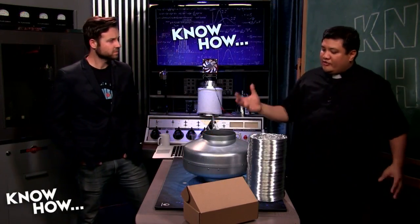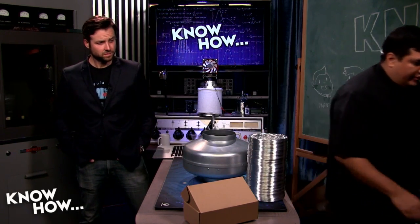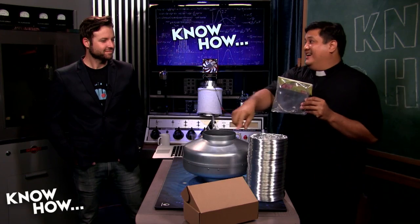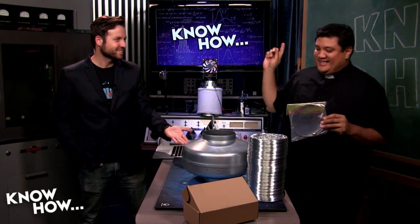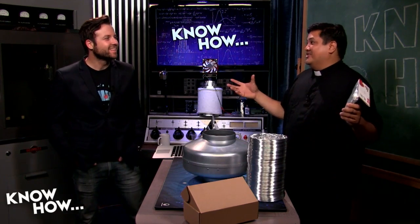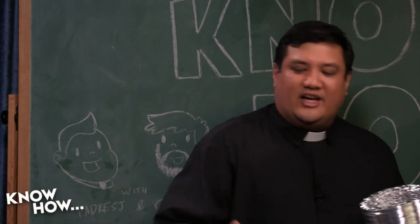But whatever kit you want, you're going to want to buy the controller, the ducting, and very important, the clamps. I've seen people just try to tape their ductwork. No? Don't. Duct tape works for everything. Don't do that. We're literally using duct tape for ducting. If you do that, I guarantee you at one point it will just peel off and you'll start spewing bad air everywhere. Yeah, you'll just come home to a mess with all your plants being dead. Dead. All dead.